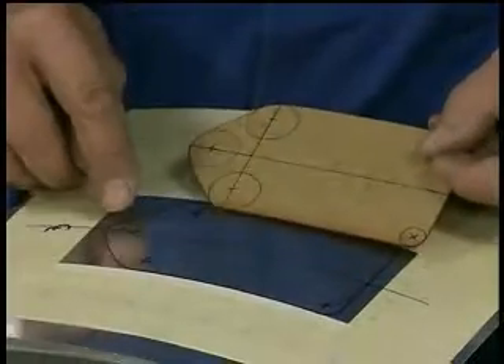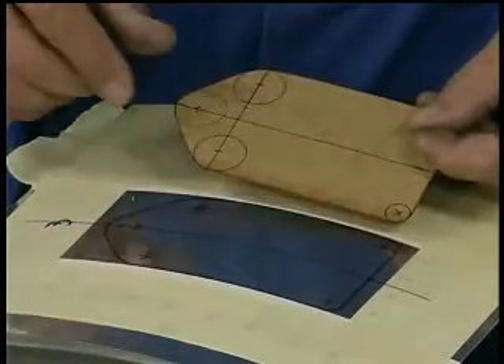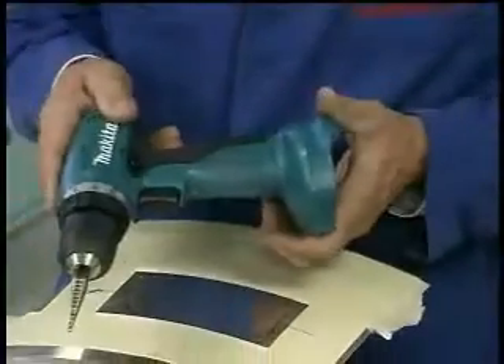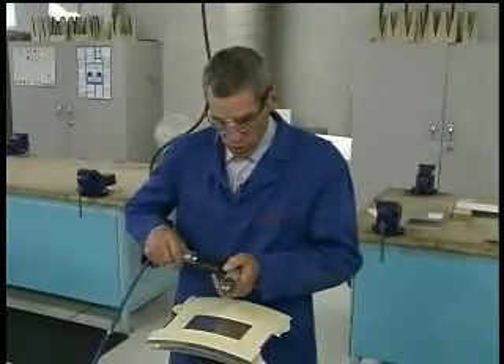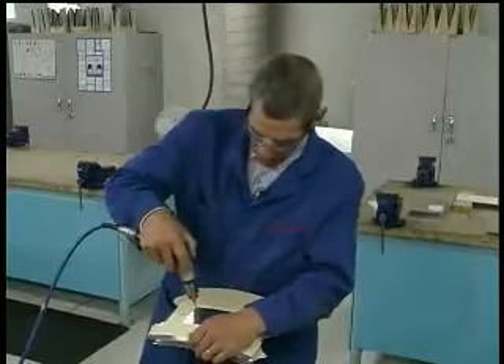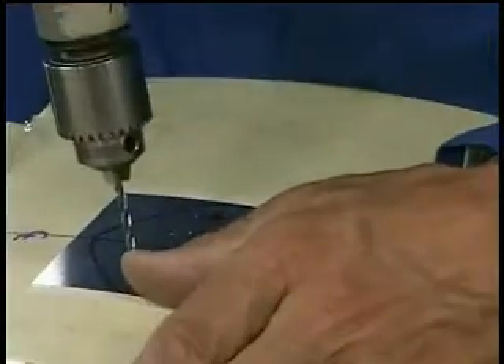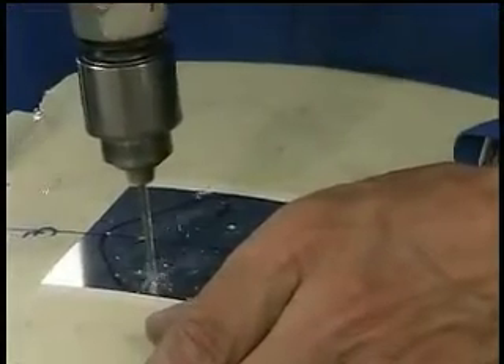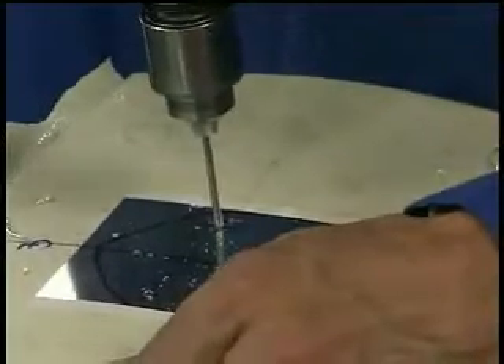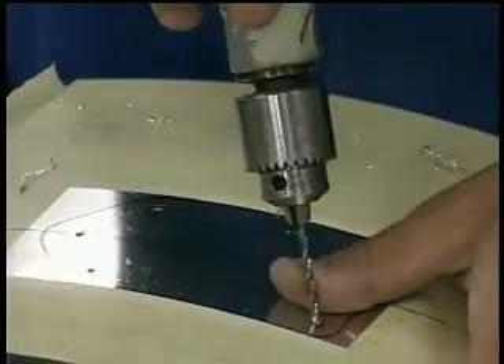I've drawn little X's on the points at which I will be starting pilot drilling to make the holes large enough to work with my hand tools. If you were out in the bush somewhere, you could use a battery powered drill. If you have access to air like we do here at SAIT, we'll use a pneumatic drill. In this case a three thirty-seconds inch drill serves as a pilot — place it on the skin and drill through at several locations. The accuracy doesn't have to be real precise; it's just a matter of getting some holes to start with.